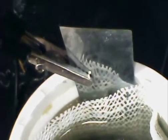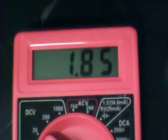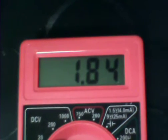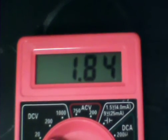I've been charging it for only about 5 minutes because of gas evolution. It goes up to about 2.2 volts, but the EMF is not at equilibrium yet, so it's down around 1.85 volts. I would imagine this will drop down to about 1.6, maybe even 1.7 volts. It started off at about 190 milliamps short circuit current.